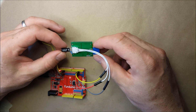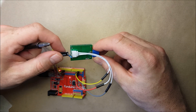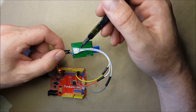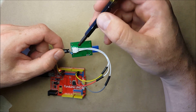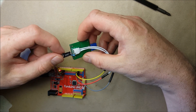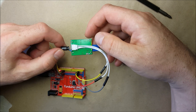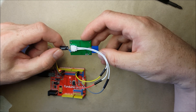So I'm very happy so far. The only thing that hasn't really been tested is the RC filter added to the power line — this device was working fine with an Arduino on its own, so I added the RC filter because eventually there will be an ESP8266 in this circuit, which is known to cause problems with these types of devices. If it works fine, I can consider the RC filter is at least doing its job even if it's not required. That is this particular part of the modification finished. I'm going to upload this video and then record a new one where I'll actually fit this inside the Sonoff case and upload some firmware for it.